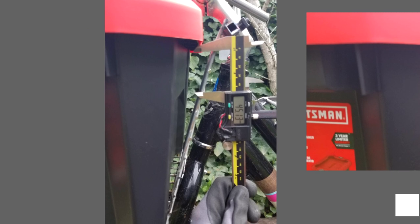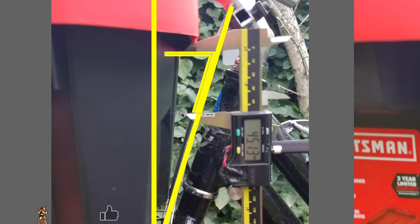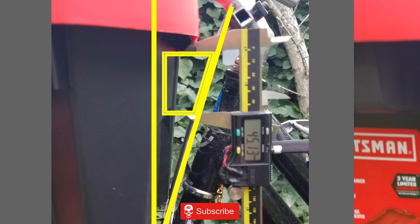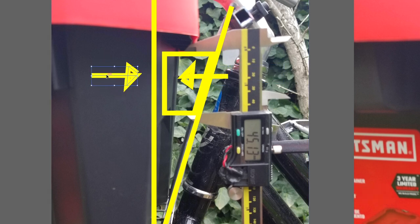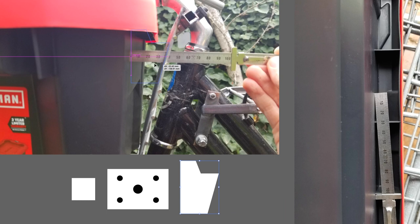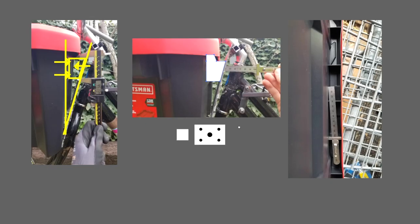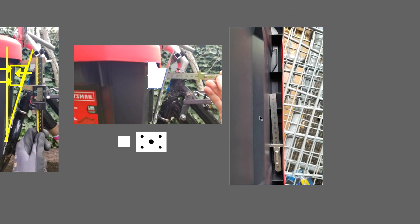While a lot of these parts are going to be cosmetic, I do need to make some that are fully functional. One of those is a spacer that is going to close the gap between the upright bin, the cargo bin, and the angled platform. I need to design a piece that can be permanently attached to the bin but with one bolt I can just bolt it to the grating to hold it in place. I always start in Illustrator so I can get a dimensionally accurate reference, using a ruler in the photos. Here is the profile, the bolt holes I need to make, and the dimension of the lip I'm trying to get to go under the bin.